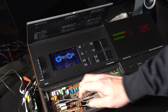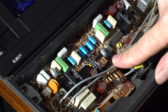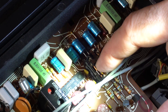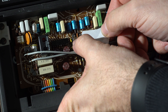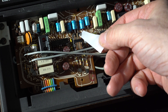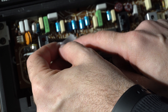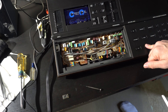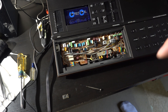It has a removable cover with a little black thing you press in. So now I should be able to clean those contacts. The end of that paper is soaked in DeOxit — let's hope it stays stiff enough to get it underneath the relay contacts. I got that in between those contacts, going to yank it out of there and try the other side too. I've run some DeOxit on both sides and the bottom. Seemed like it works. I'm going to clean it a little bit more and then put the cover back on.